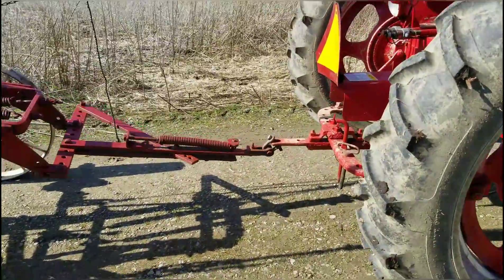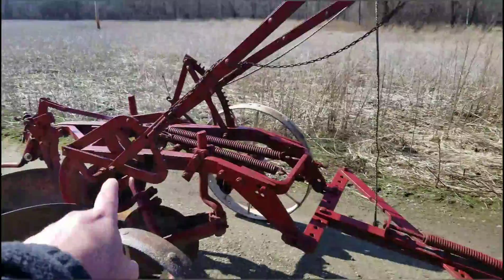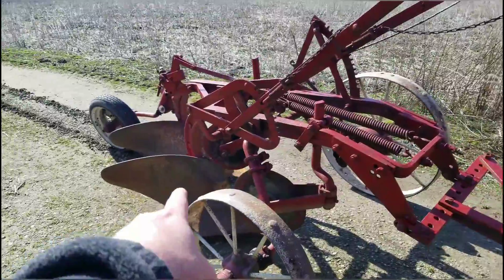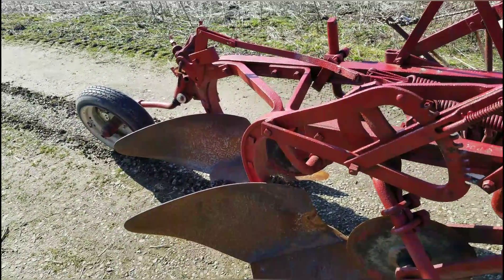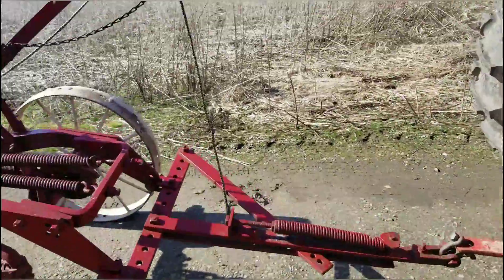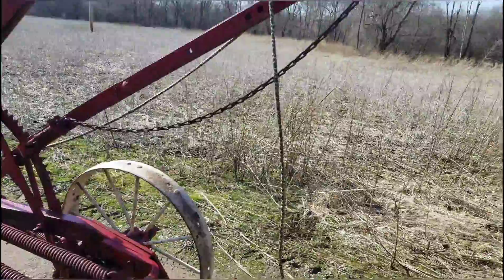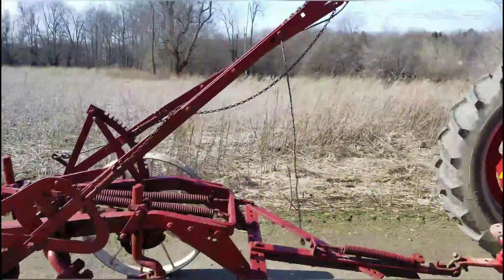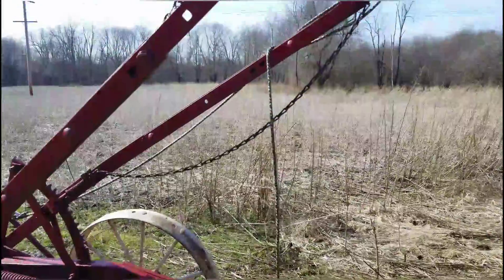The original hitch on this is also missing. The concept of it was that it was a breakaway hitch — if you hit a stump or a rock with one of those moldboards, it would give and then the whole plow assembly would break away. These are not trip plows. If you do hit something pretty serious, they're not going to trip up like the more modern moldboards. A pretty big hazard is what a lot of guys would do is take their pull rope and tie it to their seat — something that had no give to it — and that would be a really bad deal if your moldboard hit a stump or a big rock.